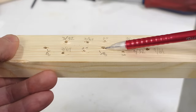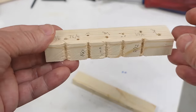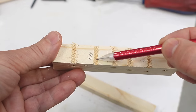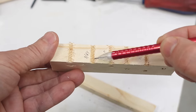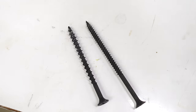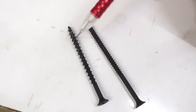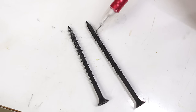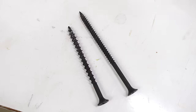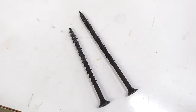Looking at my test piece of softwood, the failure seemed to be much more localized than with the hardwood. Having just cut that open, there is actually some bending of the fibers near the holes — not so much in this one because that was the largest 9/64th pilot hole, so it just sheared off. This was the smallest pilot hole and you can see some bending around here. To test thread count, these two screws have the same major and minor diameter but this one's got about twice as many threads. I yanked both of these out of softwood a few times and the pull force was almost the same — if anything the finer thread had maybe 5% more force before it came out. But this one is probably easier to drive and less likely to split the wood.